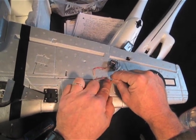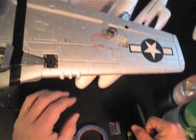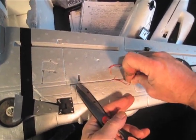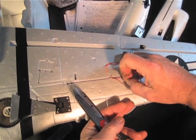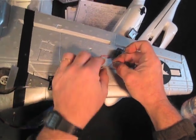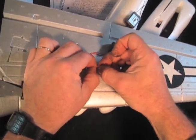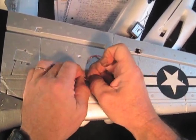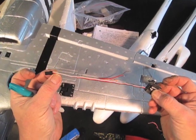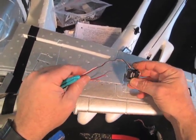If you keep these spaces equal, you can do the same thing on the other side, and it'll make a nice smooth package with no single parts of wires hanging out. So to equalize my parts, I'm going to cut this brown one a little bit — right about there. And now we strip these three wires. This is very thin wire; you can probably strip it with your fingernails — just pinch the plastic coating with a fingernail and pull. See how easy that is? Another reason for wanting to strip servos in is because a lot of replacement servos have leads about this long and they don't reach the plane. So you gotta strip it in anyway, or have a plug somewhere in the middle of your wing, which I don't want.